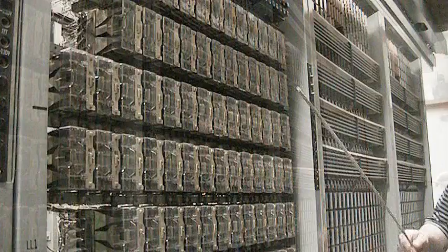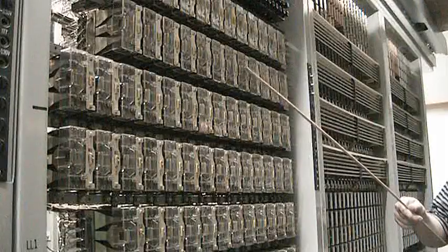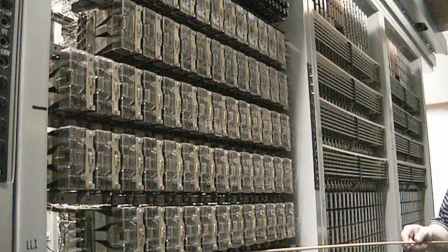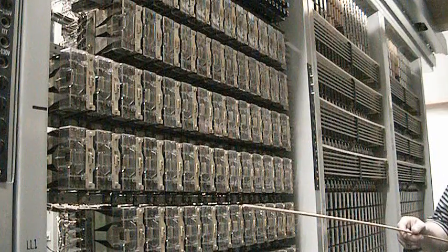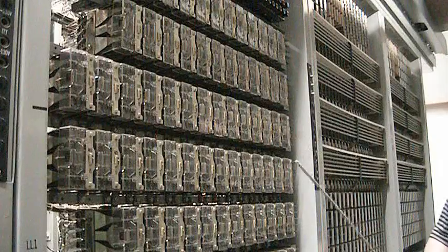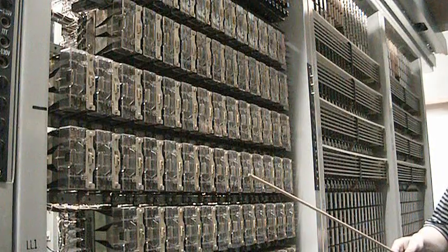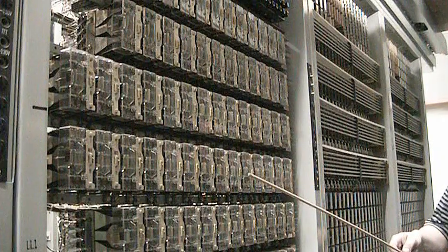At this point, we're looking at the marker connector relays. These are 30 contact relays. The function for these is when a piece of equipment requests that the marker provide some type of a function, either to complete a call or to give dial tone, you operate certain marker connector relays, which then connect a massive amount of leads between the originating equipment and the marker. Some of these, we may operate 6 or 7 of these relays in one shot in order to provide enough leads to the marker to determine the type of call and what to do with the call, what it's originating from or terminating from.